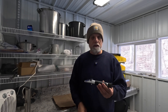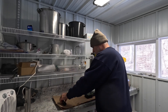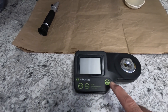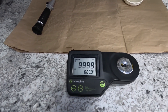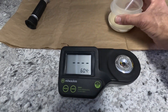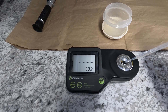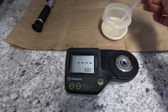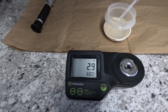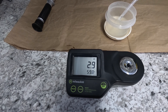That leaves the new digital refractometer. Let's try it out and see how it compares to the optical refractometer. Operation of the Milwaukee digital refractometer is pretty simple — we're just going to turn it on, wait for a row of dashes across the screen, and we're going to take our maple sap, fill this well until it covers the lens, and then hit this read button right there. 2.9% sugar according to the digital refractometer.